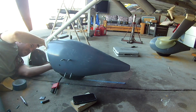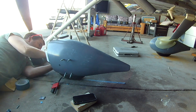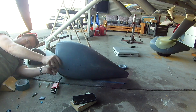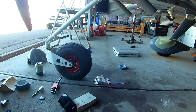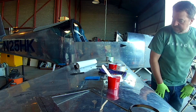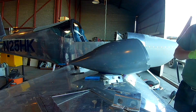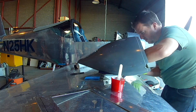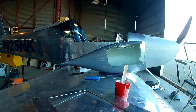Just like in the main fairings, what we're going to wind up doing — here you can see I'm marking the spot — there's one more hole to put on both sides, and that is the hole on the side which corresponds to where the toe bar attaches. You can see the side of the front fork, the main axle, and if you look really close, you can see the washers I was talking about. Slightly ahead of that is a lightning hole, and ahead of that is a small 3/8 hole, and that's got a big Allen bolt stuck through it. There's going to be a huge spacer — you saw me cut the spacers for those years ago. There are two aluminum spacers used to stand off those hex bolts, and then your toe bar attachment goes around the ends of those hex bolts, and then you can move the plane at your will.